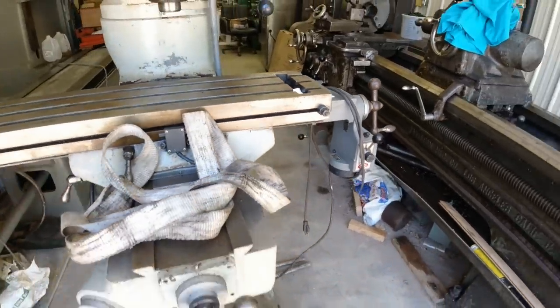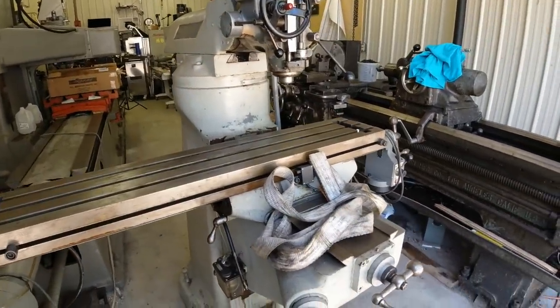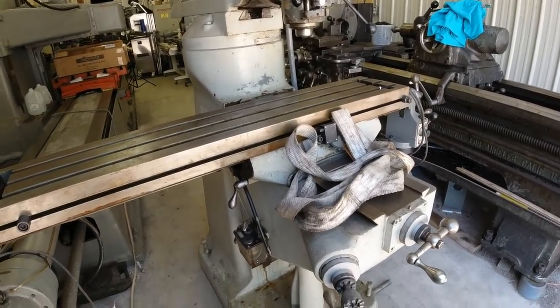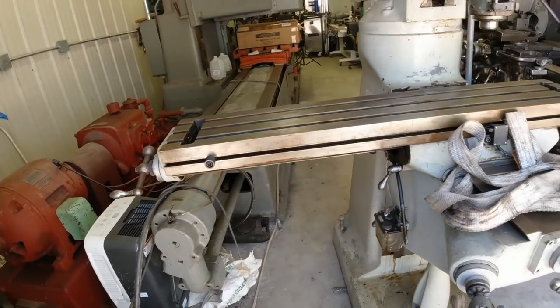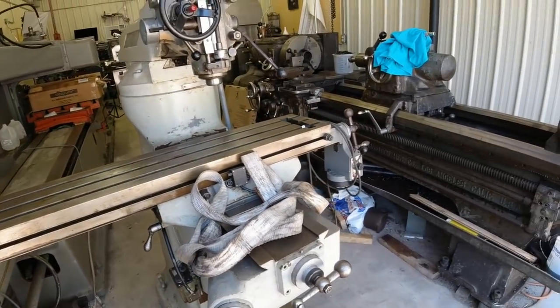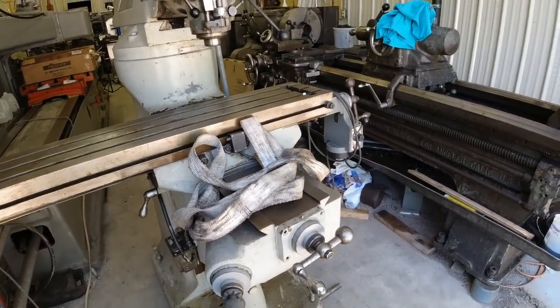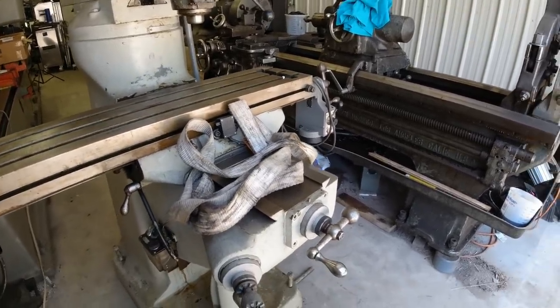And the guy I bought it from was a machinery builder. And he said, all it needs is a nut. Well, I've been digging into it, and it needs a lot more. It needs both screws, X and Y. Yeah. Needs nuts for them. Needs bearings, needs oilers, needs way wipers, and may need a ride on my planer.